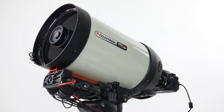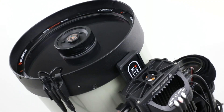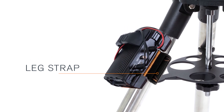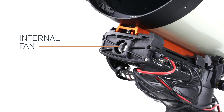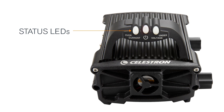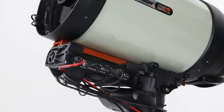To mount the controller to your setup, there are several options. Both controllers have integrated dovetail clamps, which are compatible with CG5 Vixen and CGE Losmandy dovetail bars. For many setups, this will be the most convenient way to mount. The enclosures also have slots for the included leg strap, which can be used to attach the controller to your telescope's tripod leg. The controllers feature an internal fan to keep the electronics cool even with large power loads. The bridge houses the environmental sensor and isolates it from any residual heat radiated by the metal enclosure. The status LEDs on the bridge provide at-a-glance feedback while in use. If the current or voltage becomes too large or too small, the LEDs will warn you to take action. The bridge also functions as a handy cable management feature for corralling cables and preventing unwanted cable pulls.